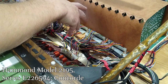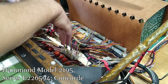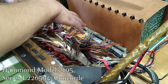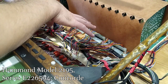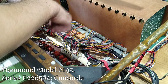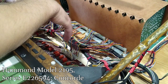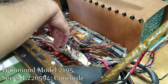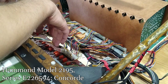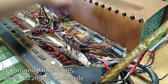I unplugged J16 and it went quiet as I would have expected — everything over here I expected to affect the top swell manual, not the lower great manual. As I was pushing it back in, suddenly I had a big full C major sound — that C definitely came back, but just for a sec. So now I'm looking at what else my hand was touching as I was pushing that in. There's some connection that was affected. I've been vacillating between just acceptance and being determined to count every wire.